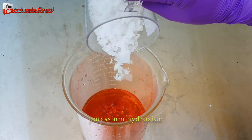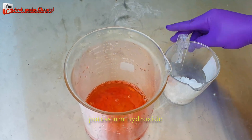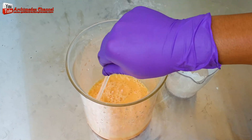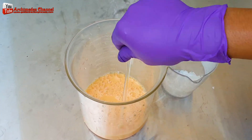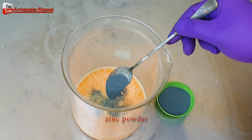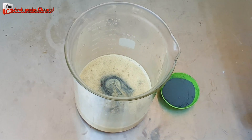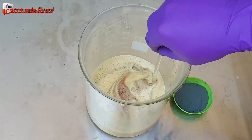Use potassium hydroxide for the gold in the solution to bind to the zinc powder. I recommend stirring the substance all the time to make the zinc powder evenly distributed so the gold will adhere to it better. Usually we use 300 g of potassium hydroxide per 1 liter of chemical, divided into 3 times of 100 g each. Do this 3 to 5 times until all the gold in the chemical is gone. Notice from the color of the zinc powder — if it returns to original color, the gold is gone.